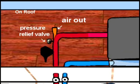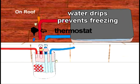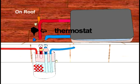On the roof near the solar panel is another pressure relief valve and a valve to let out air bubbles. A thermostat opens a valve allowing water to drip if the temperature gets below 45. This way, the slowly flowing water will not freeze.